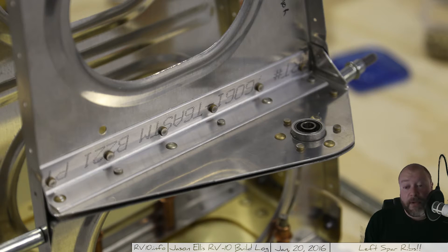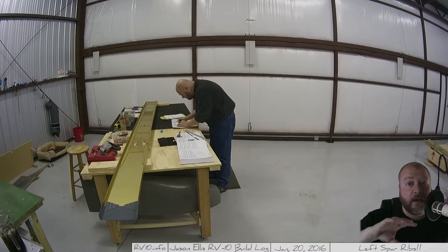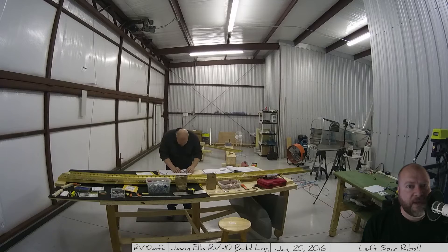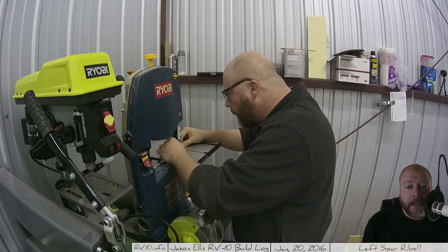For a lot of this video, what I'm going to be working on is this simple bracket that I think is for the flaps. You can see there's a gap between the top and bottom piece, and that's where that piece of metal I just described goes — it acts as a spacer along the angle bracket on the inside and a perpendicular piece along the top. You can also see that I alternated the rivets top and bottom. I don't know if that adds any strength — the shop head on rivets is usually pretty solid — but I thought I'd give it a try.